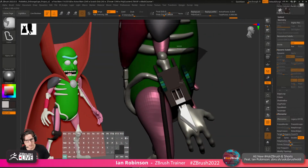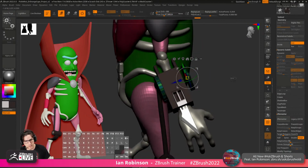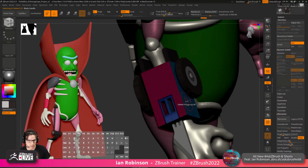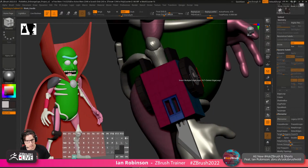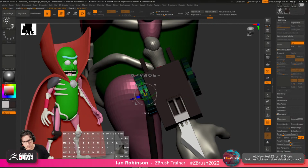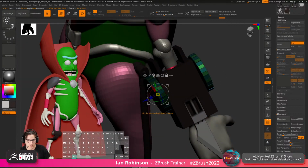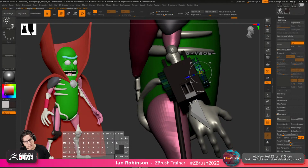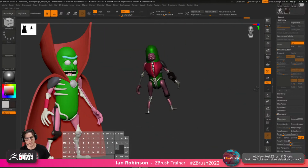We can actually just come over here. We can make this wider in our own way by just doing that guy right there. There we go. Let's come in here. We'll just make this wall thickness a little bit better. Do something like that. Actually, let's do this guy right here, make it a little bit thicker. And then I'm actually going to pay attention to the thickness. Say 1.35. That's fine. Set that over there. 1.35. Close enough. Yeah, there we go. Bit custom work there, but that should get that blade in.